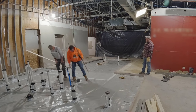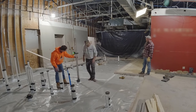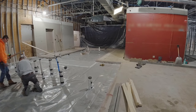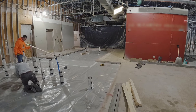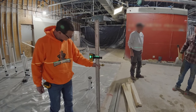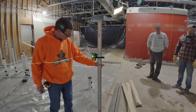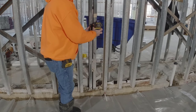As it turns out, we need to adjust these a little bit. Usually plumbers won't use a laser — they'll just run strings from one side or the other. But as we were checking these with the laser, we noticed they were off a little bit. The laser is going to be much more accurate than just running strings across the floor to set your plumbing.